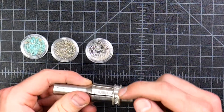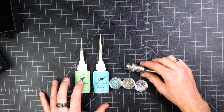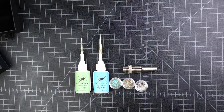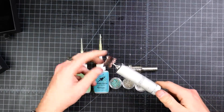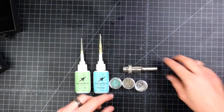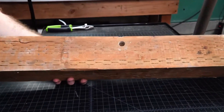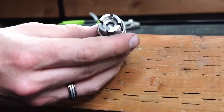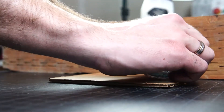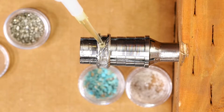We're going to start the inlaying process. This should be everything I need to get through all of the inlaying steps. At that point I'll get out my Dremel tool, put a sanding bit on it, and start removing some of the inlay so we can get it flush, then go from there with the polishing steps. Now I've got the ring on the mandrel. I've got this block of wood with a hole drilled into it — that's going to fit the mandrel in there perfectly and hold it in place, making it easier to work on and to film.